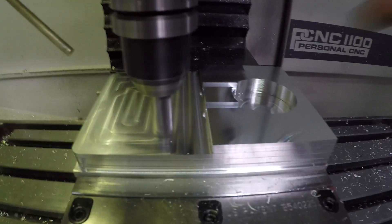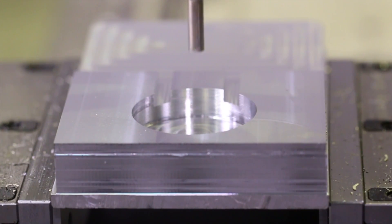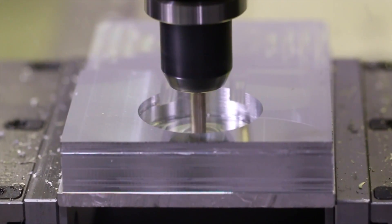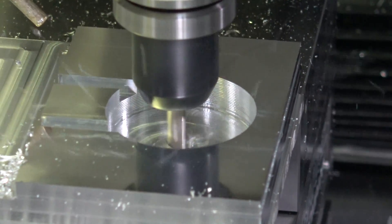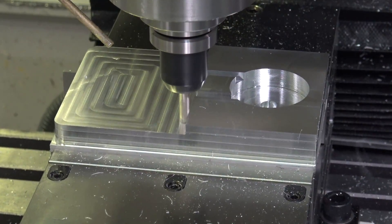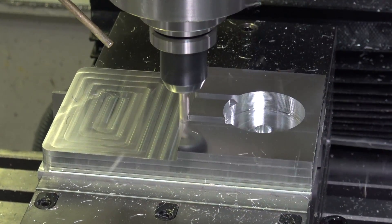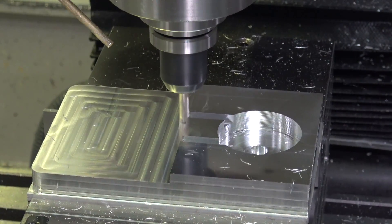The facing took off the back side. When you're doing a finish cleanup pass along a shoulder like this, keep your tool one thousandth of an inch off that bottom face - it'll avoid the tool mark you sometimes see on the bottom face.